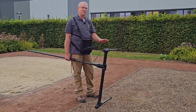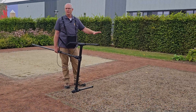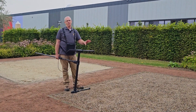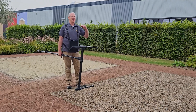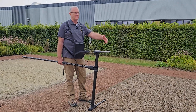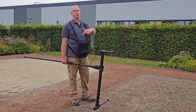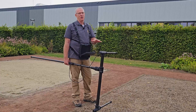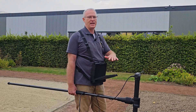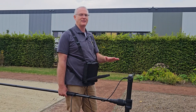The main objective with the magnetometer is to make sure that the area that you're scanning is clean. When I say clean, I mean that surface objects and metals within the first 12 inches of the surface are removed. If they're not, as you do a 3D ground scan, metallic objects within 12 inches of the surface that you're not necessarily interested in finding will show up and affect your 3D ground scan. So the first step before you do a 3D ground scan, a mineral scan, a tunnel scan, any of the modes available, is to clean the surface up — that's what the magnetometer mode does.